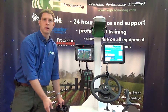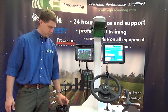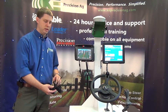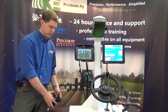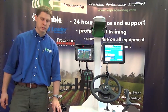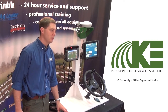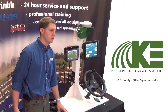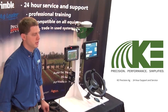That modem would connect with the internet and get RTK corrections off of the Trimble VRS network, which uses a virtual reference station. This here is a Wi-Fi antenna we can add to the top of the tractor for a connected farm setup, which would also connect with this modem. The last step would be the RTK radio — we can have a radio base station within 10 miles and connect to it for sub-inch accuracy.